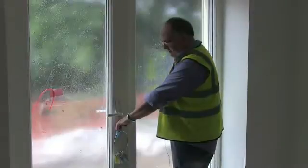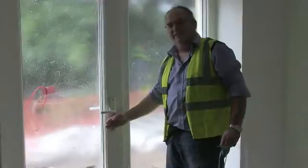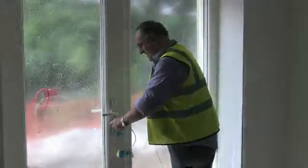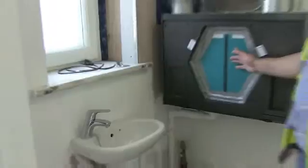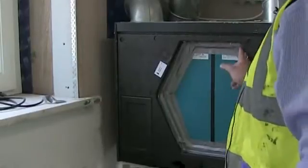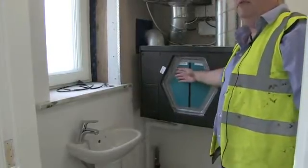There's air coming through this keyhole — if I took the key out it's much more air, you can really feel it. So everyone doing passive house tests, contractors should always leave the keys in the door — so we tape over the keyhole. This is the heat recovery unit, which is basically open to outside. It has an intake filter and an exhaust filter, so we've taped them over and sealed it up to stop air coming through this unit.